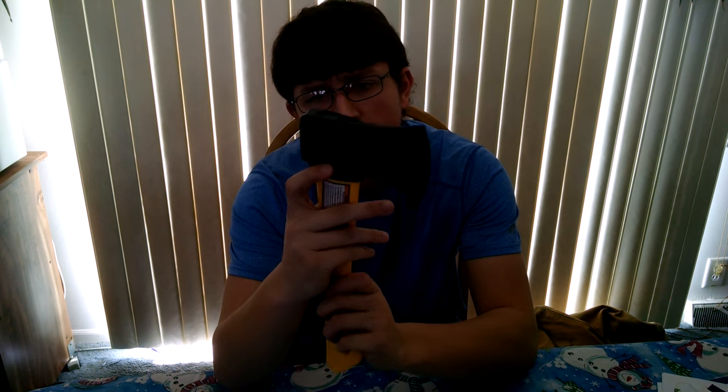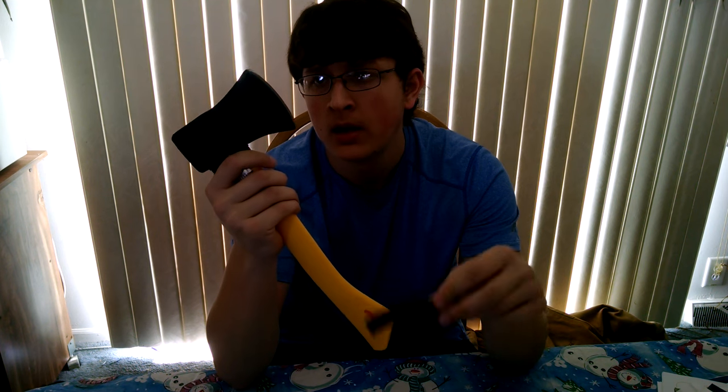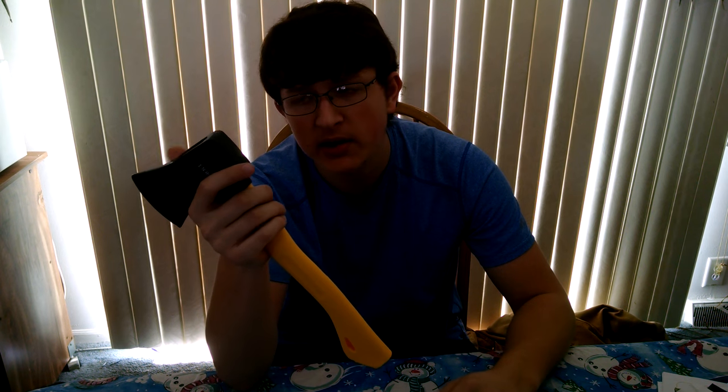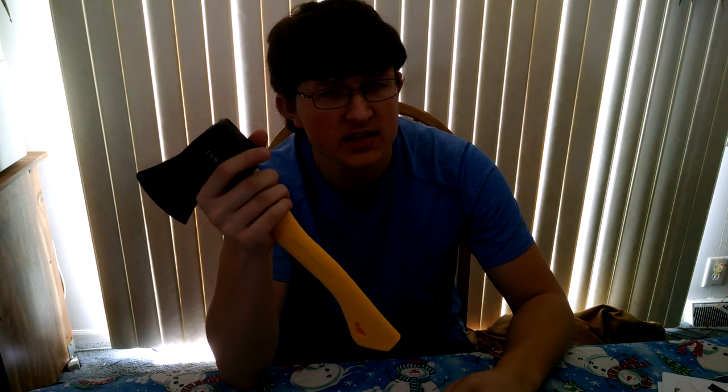It has this little rubber thing near the head — I don't know what that's for. It really doesn't do anything. It's got this chintzy little rubber protector for the blade, which isn't sharp — that'll need some grinding. It's got a nice kind of paint coating. Now, that keeps it from rusting, though over time that will rub off. But what stays on there will protect that part of the axe from rusting. So it's probably not a smart idea to grind this down so it's nice and polished.